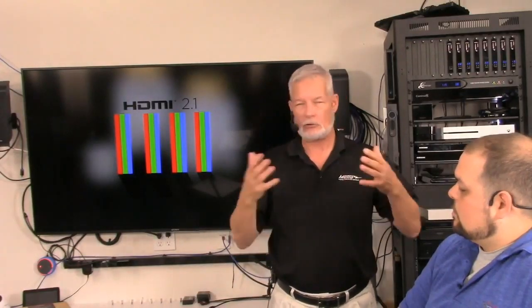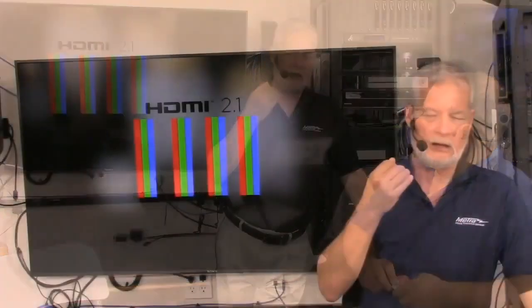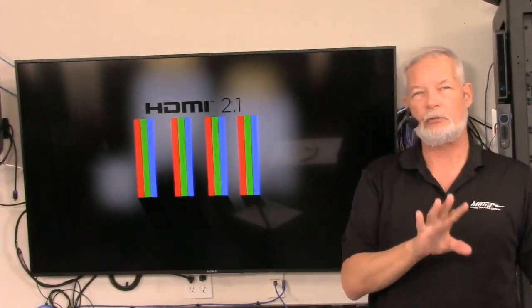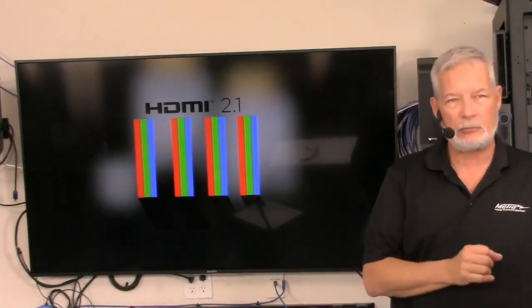So you can put those in, move forward into your jobs, and feel comfortable that certainly in the early days of HDMI 2.1, which, let's be honest, is probably 5 years on the short side, you are good to go. When you look at our products like the GA1, the GA2, the Junior Plus, the AIO, the SP2, the VCT, all of these were designed from the very beginning with 4 equivalent channels. Actually, my very first product we ever built, the DAD, will do this even now, and it's a 12-year-old product. It's not that we knew we were going here. We just built the best product we could at the time, and it turns out it gives us a full 6 gigs per channel by 4.